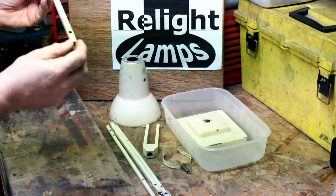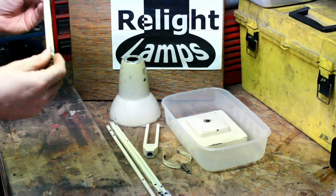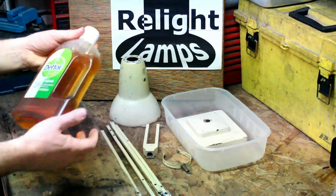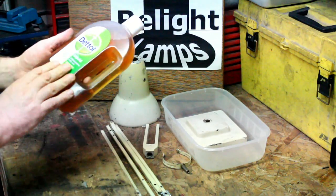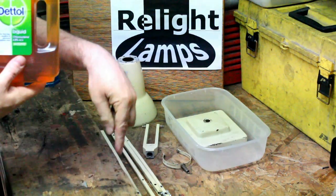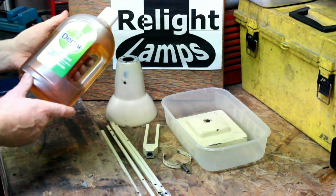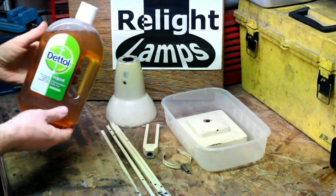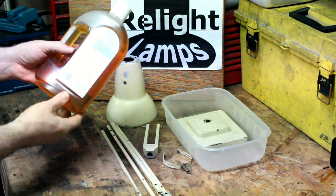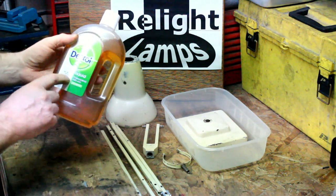So if you wish to use a chemical paint stripper, ensure that it has an aluminium-safe formula. What we tend to use — maybe a bit of a shock — is Dettol. I know it sounds daft. The details of exactly which Dettol you want to use are in the description box below, but it must have chloro-oxylenol. That's the active ingredient which strips the paint. The good thing is it's aluminium-safe and doesn't really want to try to kill you with its fumes, unless you don't like that Dettol hospital freshness smell.